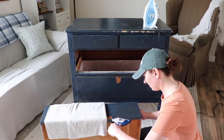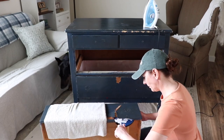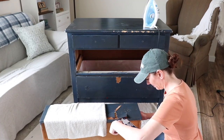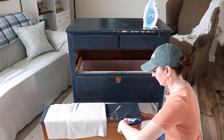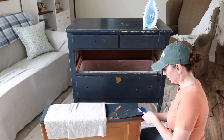Now it's time to learn a new trick. I have never removed veneer from furniture before, but this obviously really needed to be done. It was really chippy and I didn't want to paint this portion of it — I wanted to leave it bare wood. So I decided to remove it. How I'm doing that is using a soaking wet towel that I've wrung out really well — an old cruddy one. Don't use a new towel because your towel gets janky.